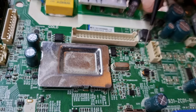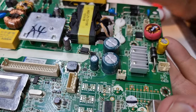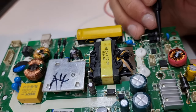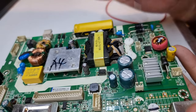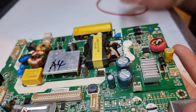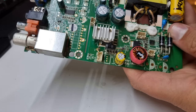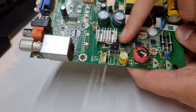The board is clearly marked. Examining the other side of the component I can see '12 volt', which supports the theory that this is a 12 volt regulator. Looking at one of the connectors I can see 12 and 5 volts, so we've got a dual voltage supply here. Somewhere else on the board is a 5 volt regulator, and with two coils present this might be generating both 12 and 5 volts. I did a little research and this small component is an MDD1903, a single channel MOSFET — so it's definitely switching in part of this little circuit. I'm reasonably confident this is a 12 volt regulator.